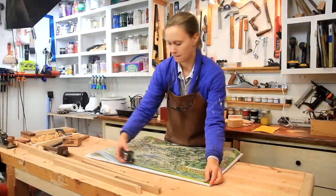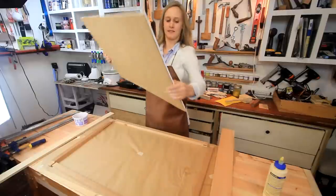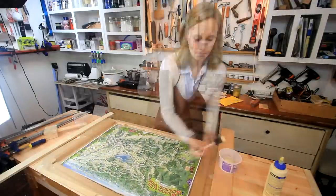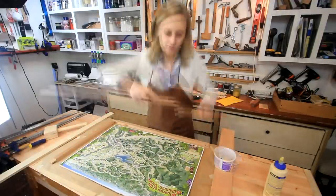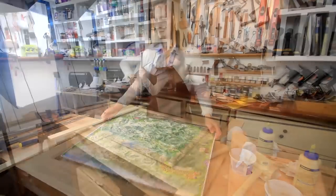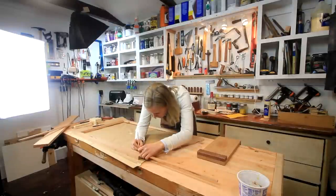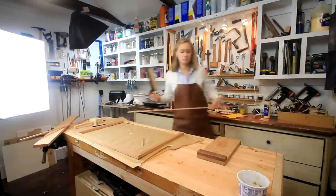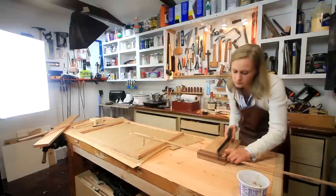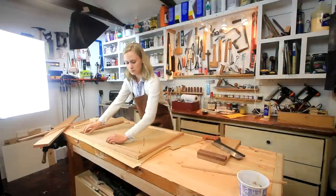Once I had my joints cut, I secured the poster to a foam board, which I trimmed to size. Then I glued the frame together, making sure to get good contact everywhere, and clamped it down so it would dry straight. In order to hold the picture in place, I cut the quarter inch strip that I ripped previously to fit inside the frame, joining with simple butt joints. I glued them in place to create a lip which the picture could lean against.